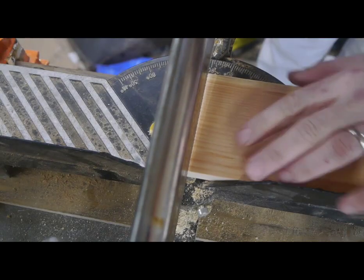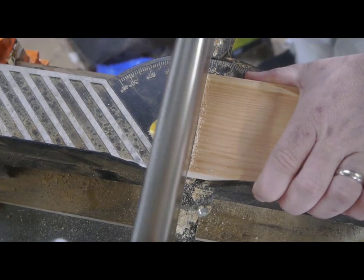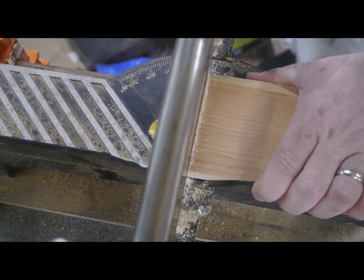There are pieces of 1x6 pine that need to be cut 5.5 inches long. These are the only pieces that need to be somewhat square, so I'm cutting them in my rather large miter box. If you don't have a miter box, don't worry. With some care you can do this freehand with a saw.